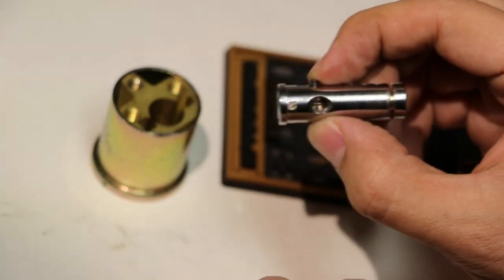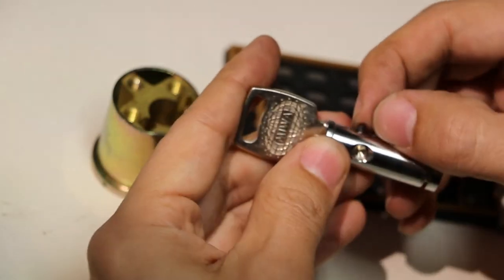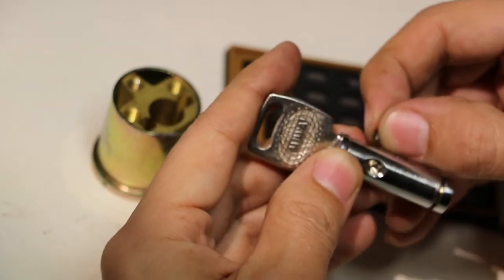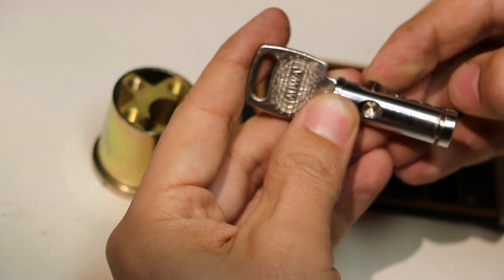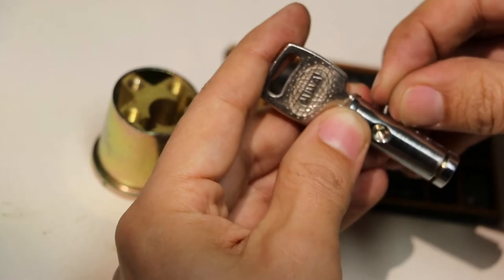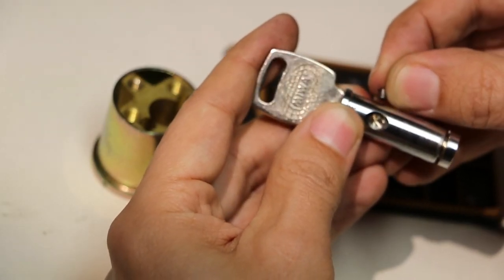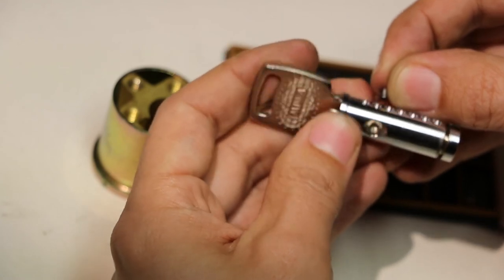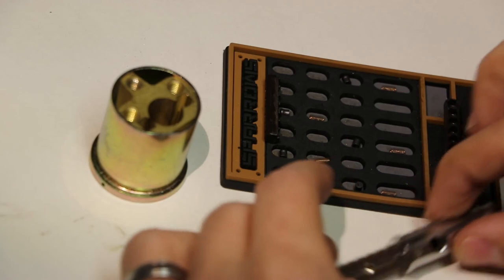So when you put the key in, they're opposite polarities, and it actually repels. Well, that just flipped over. You didn't see it as it was really quick, but it repels this out. It's gonna flip over when I, well, all right, it repels it out, right? So it pushes it out, and once it's clear of the plug, you can turn, right? Once you got them all clear. So that's kind of how that mechanism works.